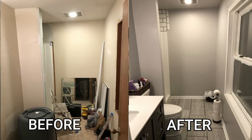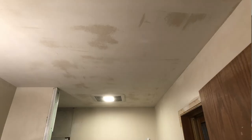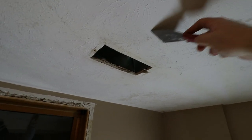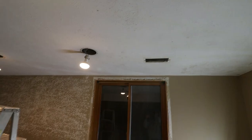I actually need your guys's help on what to do with the ceiling. In my upstairs bathroom I sprayed the ceiling with water and was able to scrape the texture off fairly easily. The problem here is this stuff is hard as a rock — it absorbs water but I cannot scrape it off. I even tried putting a little vinegar in the spray bottle thinking paint might be sealing it, and I still wasn't getting anywhere. It's absolutely a pain.